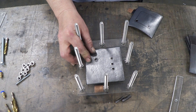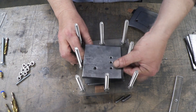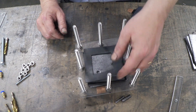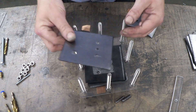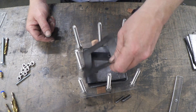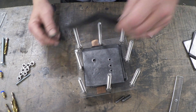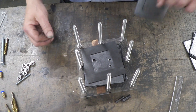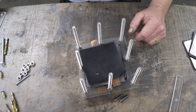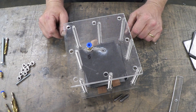Then you add a neutral plate with the gas facing to the top and the electrolyte hole at the bottom, followed by another seal. The next neutral plate has the gas facing top but the electrolyte hole the other way around — and we keep laying that up until we get to the mid plate. The mid plate has the gas and copper tab pointing the other way. We then continue with seal and neutral plate layers until we get to the other end plate, which goes the opposite way with its copper tab, and then the final acrylic plate goes on top and gets bolted down.